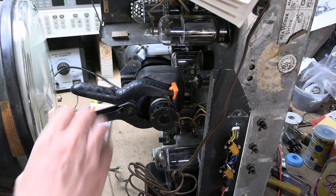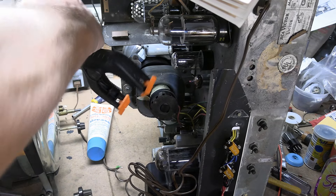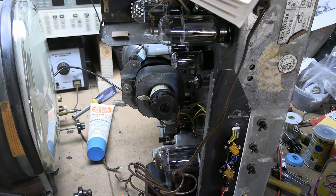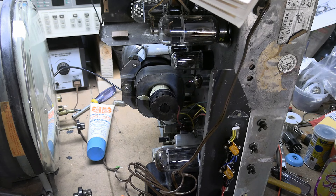Let's talk a bit more and examine what's actually going on inside this focus coil. I've got some more comments cautioning me against doing what I did. One guy cautioned me that even if I got liquid out, the evapo-rust itself is probably somewhat conductive because it's kind of like sugar water, which would be conductive. And even if it's dried out, the residue left behind may cause some conductivity issues.